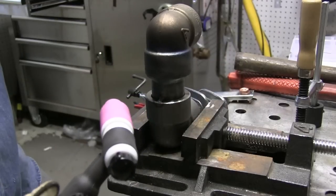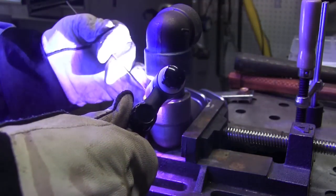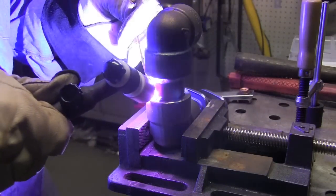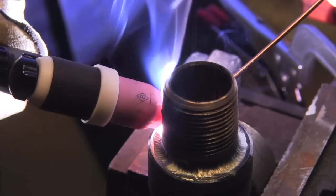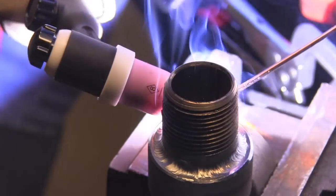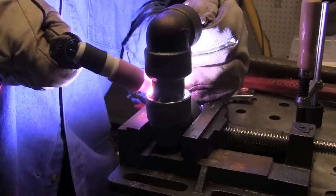I'm going to start off at 120 amps, and then I found out that 120 amps wasn't quite to my liking, so I went up to about 133 amps for these joints. 120 would do the job, just a little slower — I just liked it better at 133 because I don't like even numbers. The first pass goes in there. I use a 3/32nd filler wire — 2.4 millimeter — same size electrode, and just a little bit of a wiggle. You can see I'm actually moving the vise around here; I didn't tighten it down enough. When you're walking the cup you put a little pressure on the piece to keep the cup from slipping, so it's a good idea to have your piece locked down. When you hit a tack, you can pull your filler wire out for just a minute so you don't deposit a really heavy section of metal, or you could just go right over the tack.